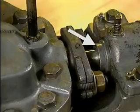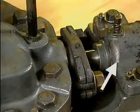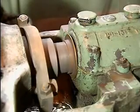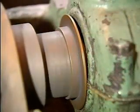The flinger is a collar that is attached to the pump shaft between the stuffing box and the housing for the shaft bearings. The flinger is referred to as a slinger in some plants. It's designed to prevent the controlled leakage between the shaft and the pump casing from getting into the bearings that support the shaft.